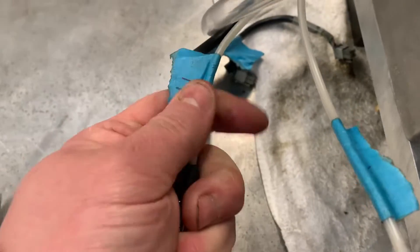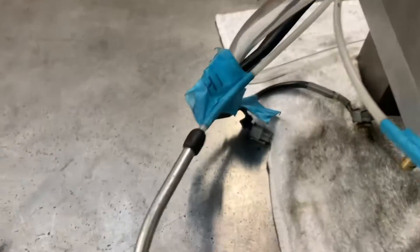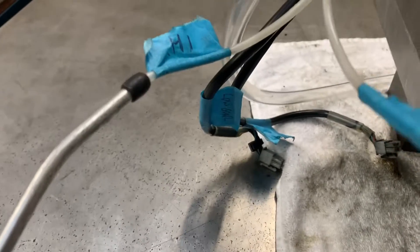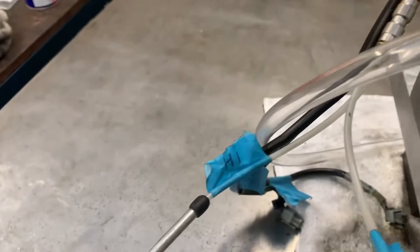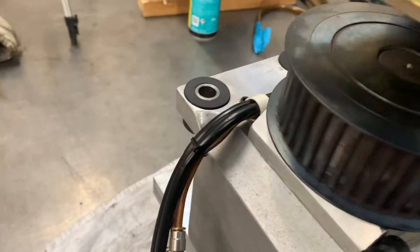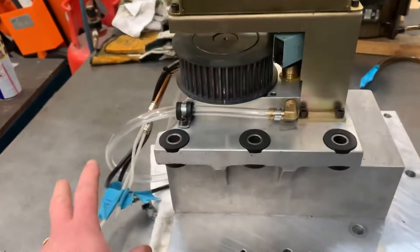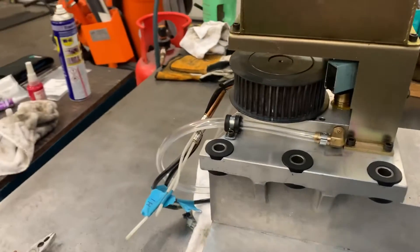On all their new O-rings. Same again - if I now put it in the high, you'll see the shaft go down. No air leaks, nothing coming out of anywhere, all lovely and silent. So yes, that kind of confirms that the seals are doing their jobs. It's a little check to make sure that via the whole high/low airline system, it is shifting gear correctly.